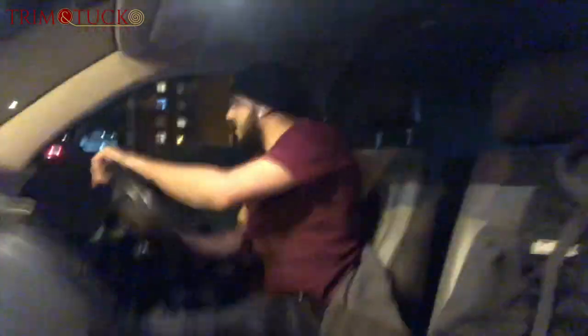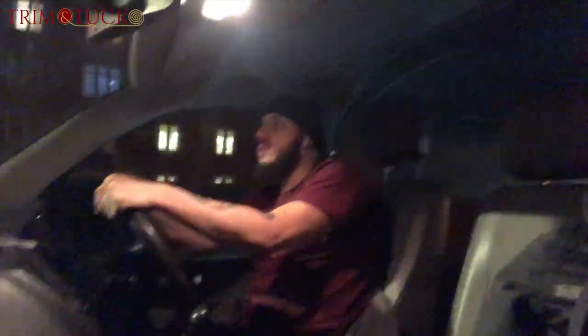So yeah, we keep you updated. We're done for the day, got Duncan off and just going back to the warehouse to drop the van off. We prepped up the whole job — it's been a long day — so the hard part's done now. Part two will be opening the rooms. The carpet is getting delivered tomorrow and we're going to let it acclimatize for a couple of days so it adjusts to the temperature of the property, then we'll come in and start fitting the rooms. The customer also wants their stairs done, but they're getting a kitchen extension so they want the stairs done in January.